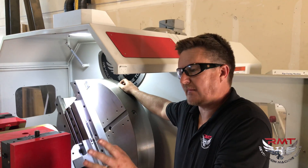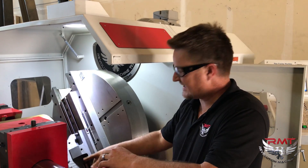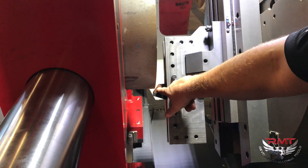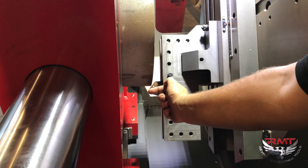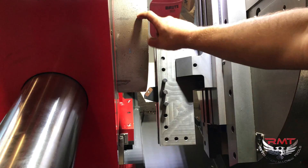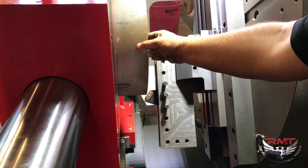I am Kyle Jorgensen. Today I'm going to show you how to use fixed tooling, or set-angle tooling, on the pipe master. I've got a set tool here at 37 and a half degrees. I'm going to program the machine to come into a certain depth and return. I can set my feed and my RPM. This pipe is an old piece of P91 — it's a 0.600 wall.